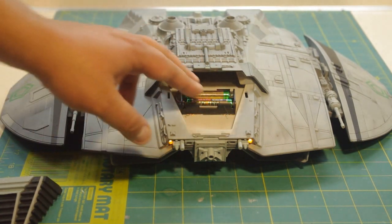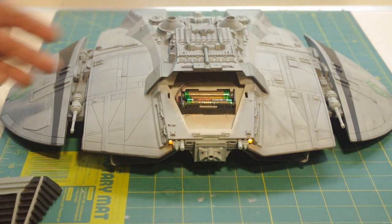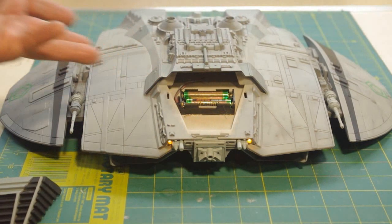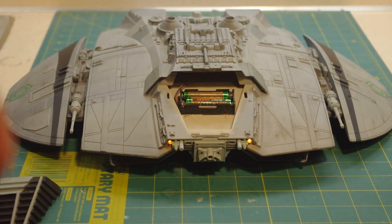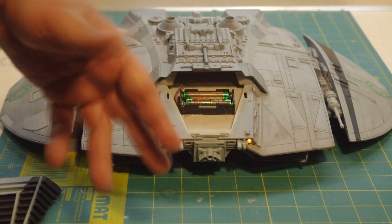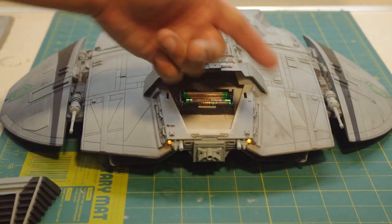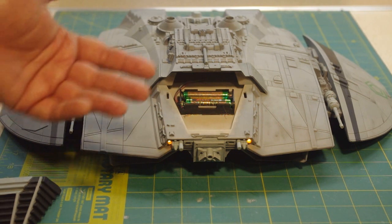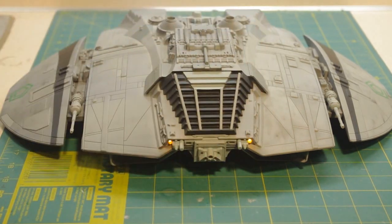I know it is something of a cardinal sin in electronics to mix different component sizes together, such as LEDs, without using resistors to balance the current. But in this case I was able to get away with it. This is relatively low voltage electronics — only three volts — and the resistance values of the LEDs are about the same anyway. If I was doing this with 12 or nine volts, I'd probably put some resistors in there. For six LEDs at three volts, it's not really necessary.